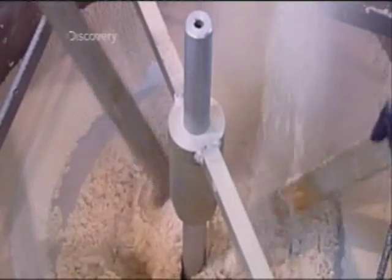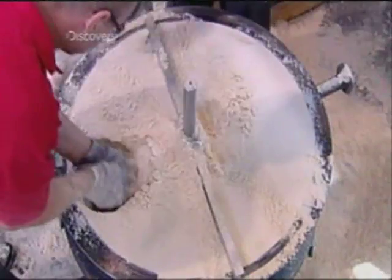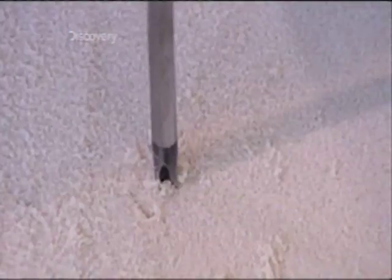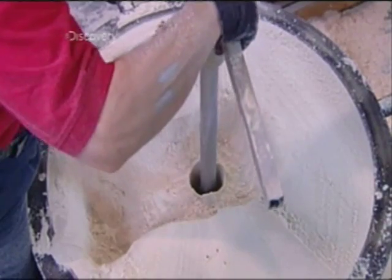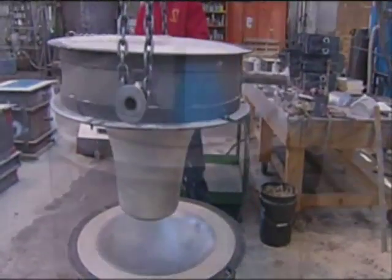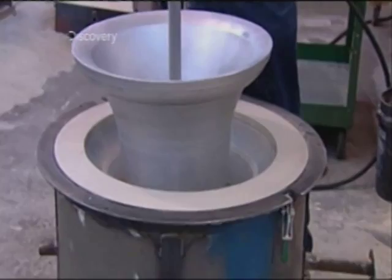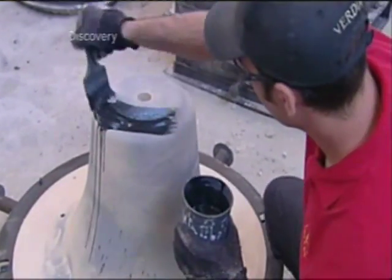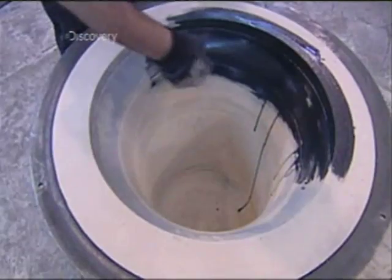Now they go ahead and top up the sand. Next, they form a funnel around the central channel to pour in the molten bronze. They poke the sand mix to make sure it's set, then pull out the gate. They separate the two casings, each of which contains a section of the mould. Then the patterns come out, vacating what is now the mould cavity. They tidy up the mould walls. This powdered graphite solution will act as a barrier, preventing the hot metal from eroding the epoxy that holds the sand mould together.